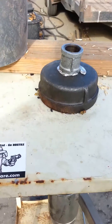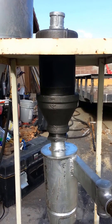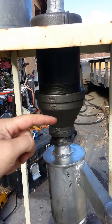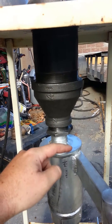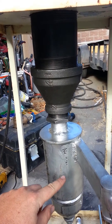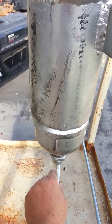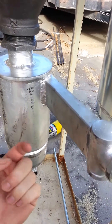It comes in here with a four-inch pipe cap and drops about eight inches into the funnel. Right in this area is where the air is supplied from above, coming down to roughly here — so that's where the fire is. I have a swirl filter built into the same area where the reduction layer is, coming to about here. The shaker grate is right underneath that, hooked up to this piece of all-thread — you just shake it back and forth a little and everything falls down, including my torch.